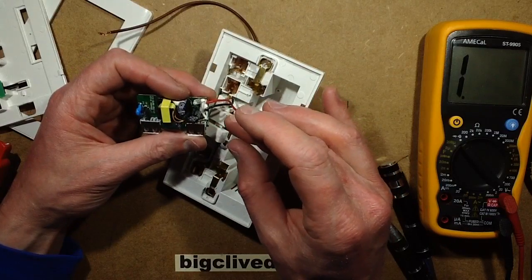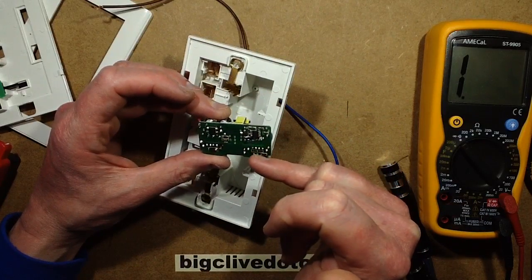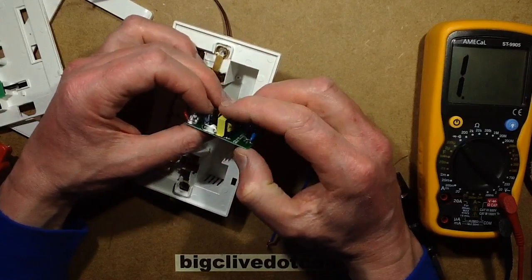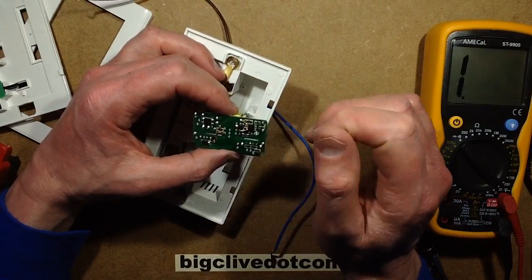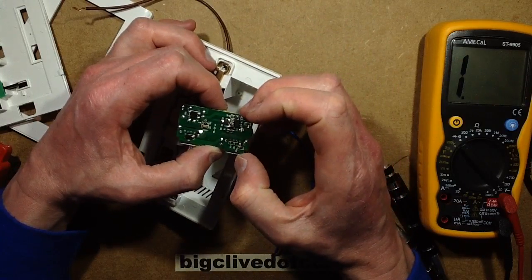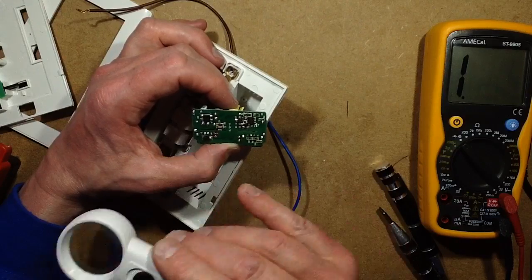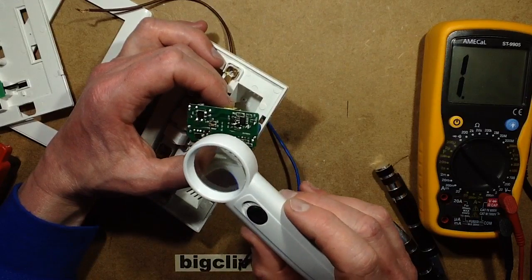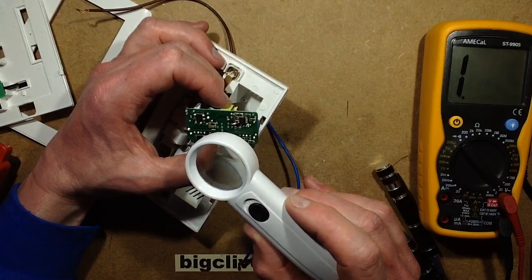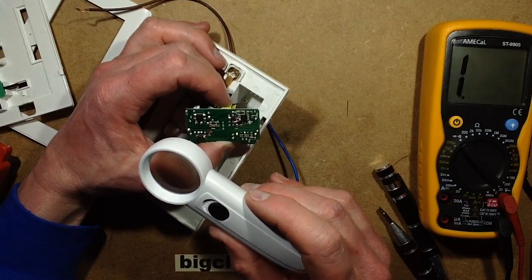I'm not seeing an opto-isolator. I'm guessing this probably uses the feedback winding, and that's why the voltage was varying until it was loaded down - because it hasn't got a very decisive feedback. I'm also noticing that this one doesn't have the little resistors mounted between the data pins. This socket has the two middle pins connected, but no resistors fitted. Normally both middle pins connected means 500mA - so the iPad was being quite hungry drawing 900mA.